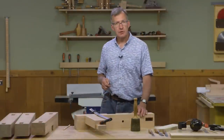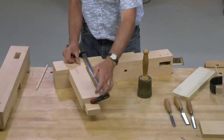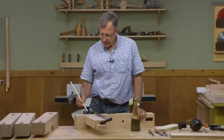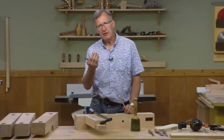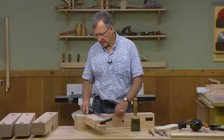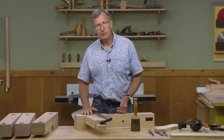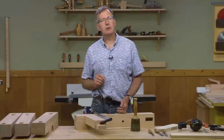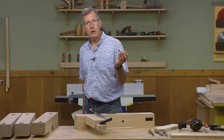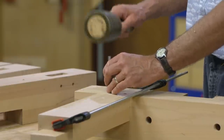One interesting element of the English workbench is the use of draw bore pins. I have two holes drilled earlier, and there's a large tenon which goes into this mortise. When we go to insert our dowel, the hole is actually going to be offset ever so slightly — about a thirty-second of an inch — so that as we drive the dowel in, it will pull that joint even more tightly. With my parts clamped together temporarily, I need to mark the location of the holes on the tenon. I'll take a three-eighths inch brad point bit — the same one used to drill the holes — place it in, and tap it a few times.